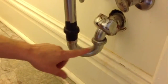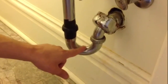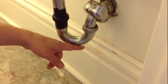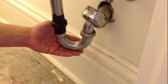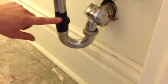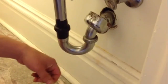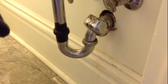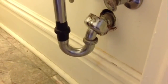Also, before you try those first two things — especially the coat hanger — make sure your P-trap is in good shape. I don't want you poking a hole in it. If you can poke a hole in it, you might need to replace it anyway, but if you do poke a hole in it, use some electrical tape and seal it up just to at least get your drain unlocked. So there are a couple of tips for you to try for unclogging your drain before you really get involved. Thank you.